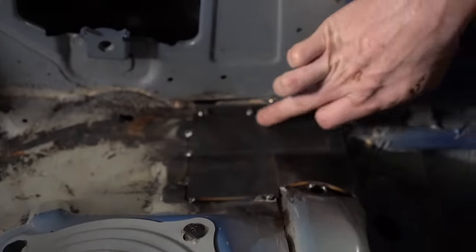This one's going to wreck your hole saw or whatever you're using to notch your tubes. Heavy angles will do a lot of damage, but you can easily cut this notch a couple times and it's just a lot easier to shorten the tube from this end in. So I'm going to take my two measurements from here to here, from here to there, make my raw material cuts, put these notches in it, and then we'll pick up from there on how to get them to fit perfectly.